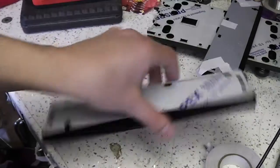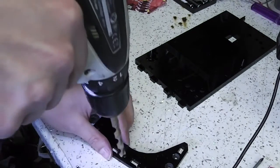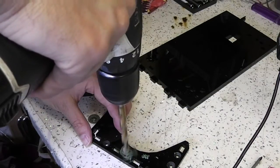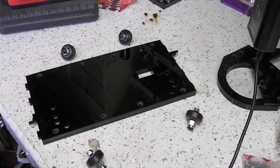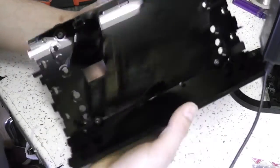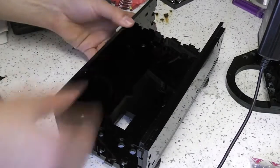I'm just taking the tape off now and you can see that part is very securely held together. There you see I took an 8mm drill bit and I'm countersinking the bolt holes where they meet what will be the outer faces of each of these components. I had to take the V-wheels off to do that but like magic they're back on and I'm fitting the side pieces now into the tabs on the base plates.